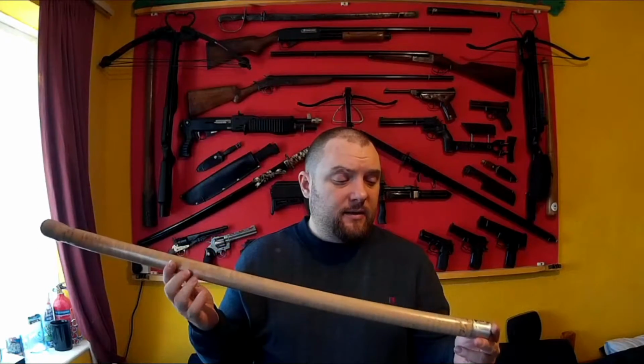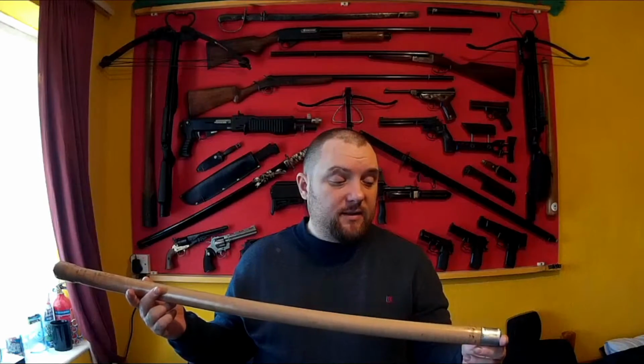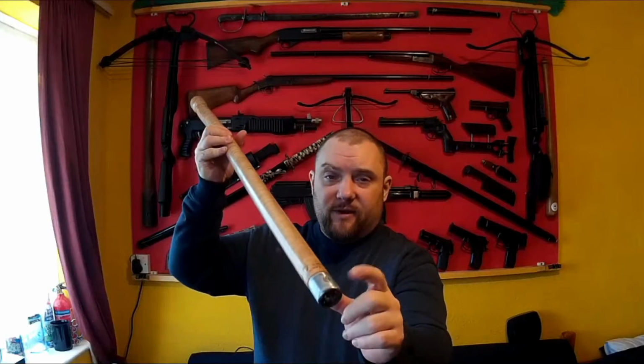I'll do this bit just slightly better, cut that in slightly more. Yeah, like I said, it was easy to do though. It took about 2 hours, all using very simple tools. I used my little cheap bench grinder, belt grinder, just to speed it up a bit, help shape that top just a bit quicker, especially that bit, and sand down there. But you probably wouldn't even need that. All you'd need is a vise and some brass files and some sandpaper and stuff like that, and a hacksaw to cut the metal, maybe a drill.